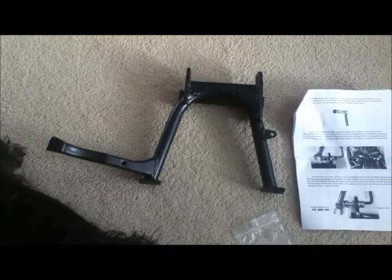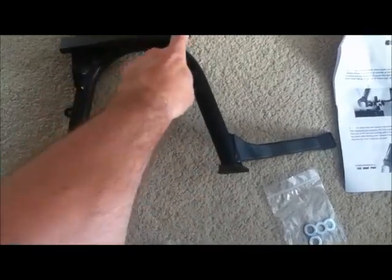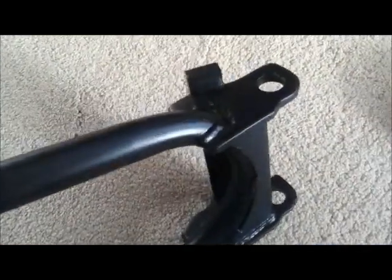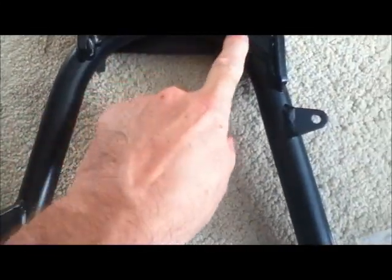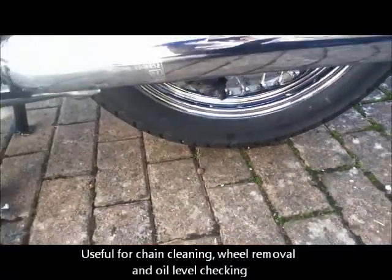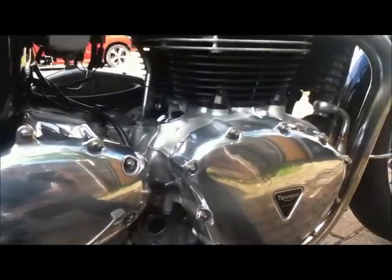This is the Tech Bike Parts stand that I've bought, ending up paying £88. It's really sturdy, really heavy, with a big steel bar across. I have to say I'm not impressed by the quality of the welding — this is very agricultural welding, there's blow-through there. It's poor quality, very strong but just doesn't look well made. The thing is, it's going to go underneath the bike and get abused, so it doesn't have to be brilliant or look fantastic. It brings the back wheel off the ground for maintenance, and also where I store the bike, the bike needs to be upright rather than leaned over. The casings are really lovely, clean and polished up.